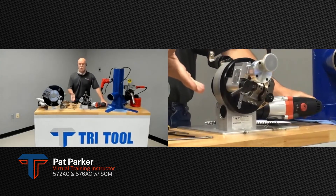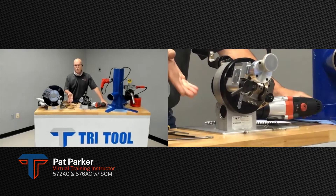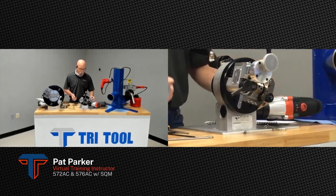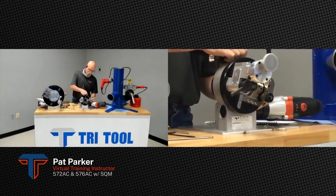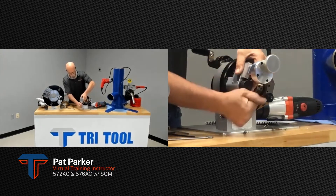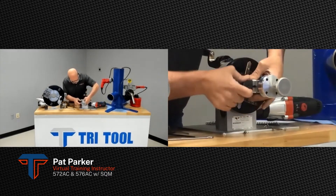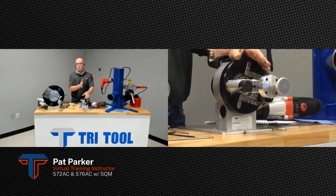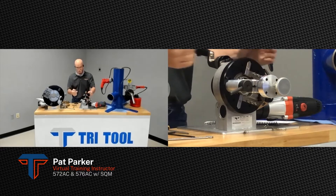Our part drops off — that side has the burr on it with that type of tooling. You can hear it auto-retract. At this point I can pull back the tripper pin and feel and see if there was a burr. If you have electro-polished pipe, you can run the tooling really close to the outside just to get the whole face of the tube. With the helical grind on the tool bit, it makes the chip go outside the tube — it won't go inside.